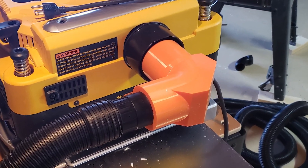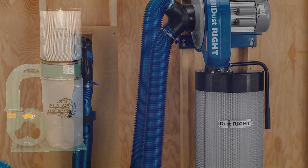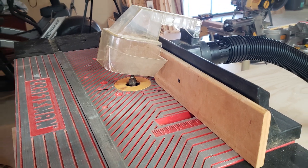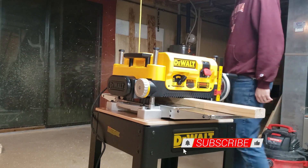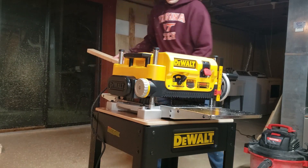Let's start with why it doesn't work. Quite simply, a planer like this is designed to be used with a true dust collection system — those large tank-looking units that sit in the corner. They work by pulling a ton of air through them: low pressure, but high volumes of air flow. Shop vacs on the other hand are lower volume but much higher pressure. Shop vacs are great for some tools, mainly ones that put out a small to moderate amount of sawdust. Compare that to this planer — this puts out some serious sawdust. Couple that with the fact that this planer has an active blower system to push the sawdust, so it clearly wasn't meant to be used with a shop vac. Hence, the nozzle's not aligning properly.